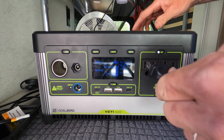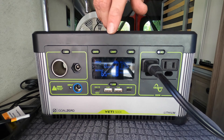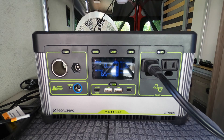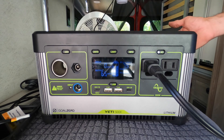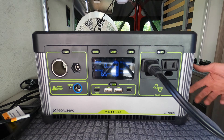So this is again the battery — it takes just a second for this charger to kick in on these Makitas, the fan's got to kick in. So 65 minus 7 is 58, so this little charging station for the battery will use 58 watts. But again, you have to turn the inverter on to run it, so you're looking at 65 watts total. Throughout the day if I'm out and about, I can recharge these batteries five or six times, no problem.